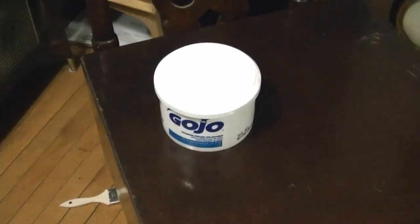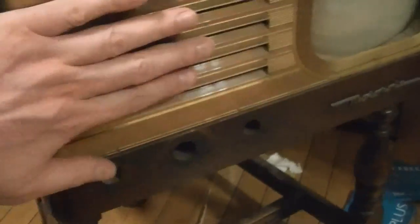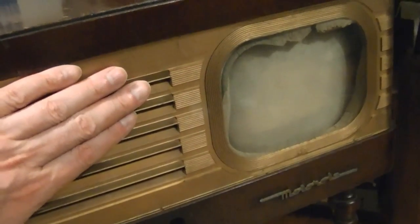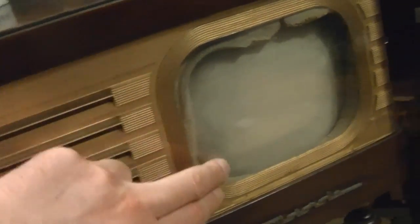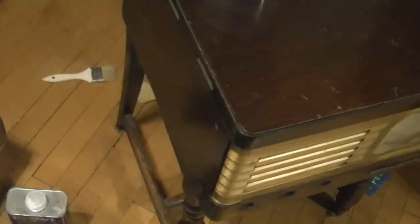The first thing I want to do is use some Gojo to clean up the wood — I imagine there's some dirt and old wax built up on it. I'm also going to pop these caps off, take out the screws to remove the lower trim, get the plastic faceplate off, and clean that up with Novus No. 2. It's got some scratches and there's some funkiness, probably just dirt on the inside. Once I get it cleaned up I imagine I'll find some latex paint splatters to remove with steel wool, and there's some sticker residue from the auction. Then maybe doing something with these scratches — maybe some Howard's Restore Finish. I definitely do not want to refinish this; it's in far too good a condition for that.